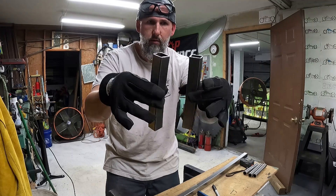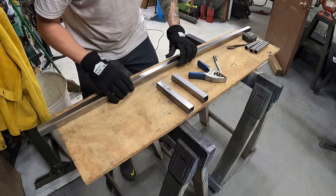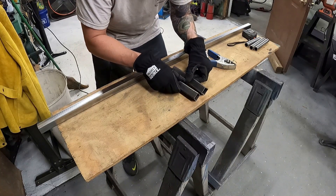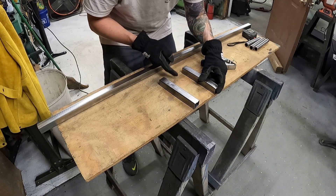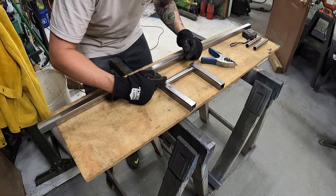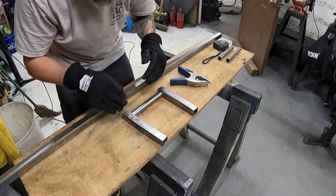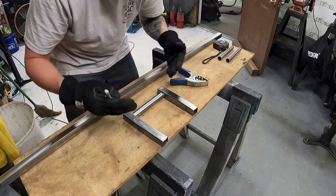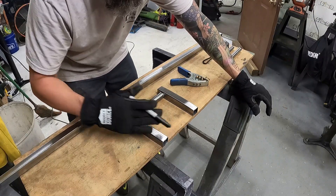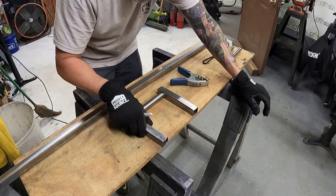All right, so I got my two tubes — they have a slight angle in them. I'm going to want them to turn in this way, so I'm going to lay them down like this. Make sure your bends are going in the right way or you'll find out the wrong way. They're going to go like this — I want them inward — so my center is coming in down there. Then you just want to measure from the bottom to where you want to drill your hole. The bars are coming off this way, which is pretty neat about square tube: it only has one axis you can go on.